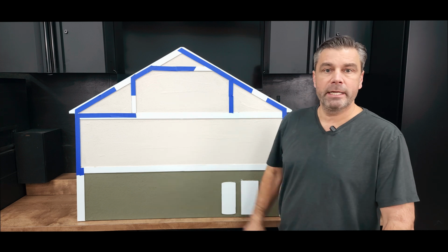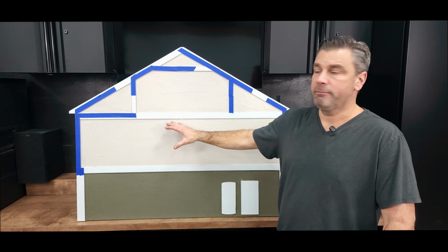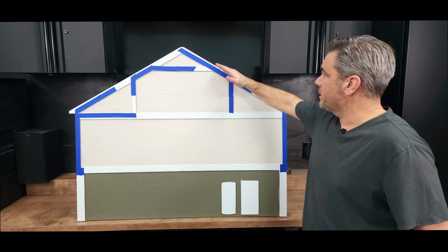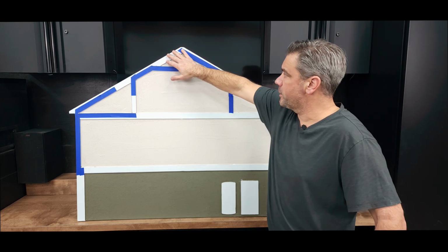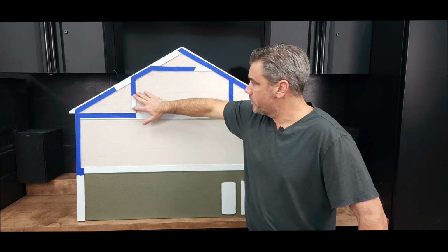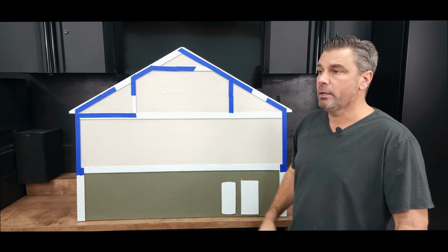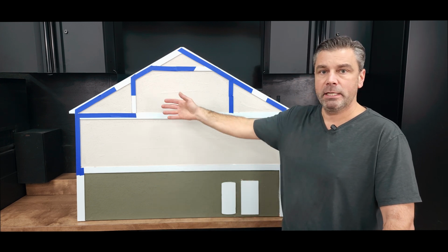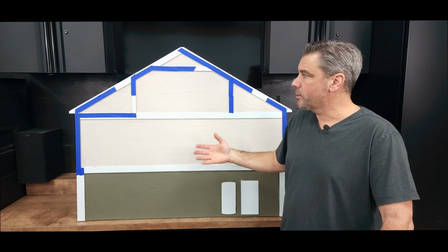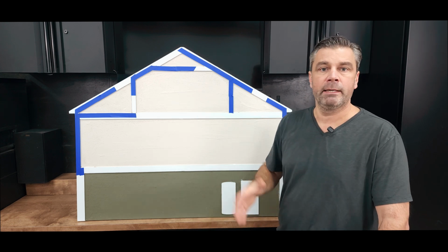Over the course of the last 80 years, 5 people tried to insulate it. 5 people had 5 different thoughts. So most of the time they tried to insulate the slope. It's fallen down here. It's missing up here. It landed on the flat. Somebody didn't weather strip and foam board a hatch door, whatever the case might be. Usually this is easily solvable by patching in those other areas, or if somebody wants to do it and bring it up to today's standards, we would normally pull it all down and start over.